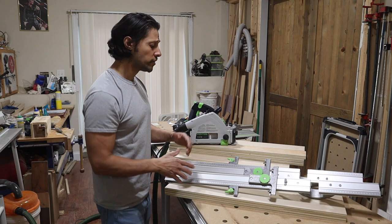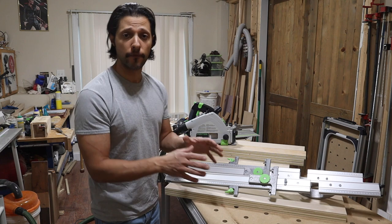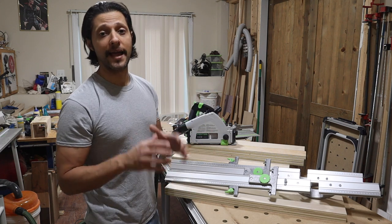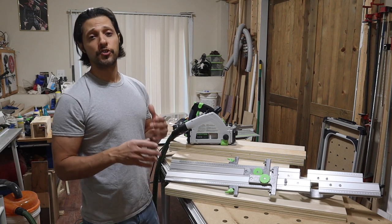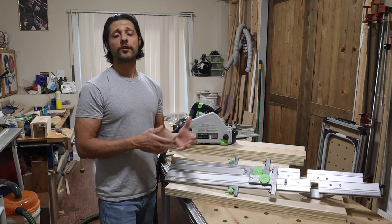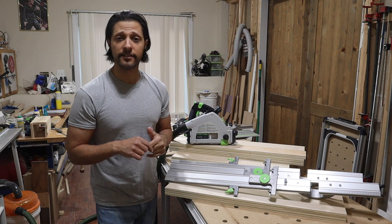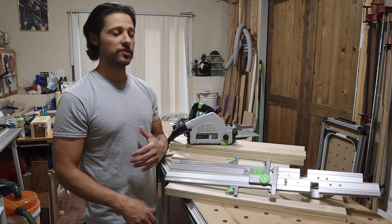You can do this with a circular saw with a couple of saw horses, on a work table, or on the floor the way I used to do it with pieces of rigid foam laid down and the sheet of plywood or melamine on top. You need a good track saw and a track, or a circular saw with a homemade track, or a straight edge clamped down after you make your markings — though that's not as accurate. I have a video on my channel showing how to make one of those tracks; I'll link it in the description.